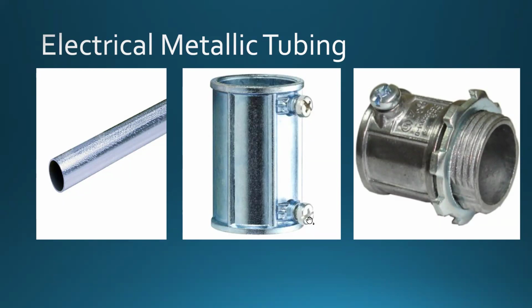Here's the problem with this, right? I'll give you the problem, I'll give you the solution. These couplers and this whole system is not meant for holding weight. This is just for proper alignment. Usually it's being mounted in a horizontal way or vertically. However, if it's mounted vertically, it's on the wall and the pipe would be fastened to the wall using different clamps or whatnot. So this coupling here is not going to hold the weight of the pipe that goes down.